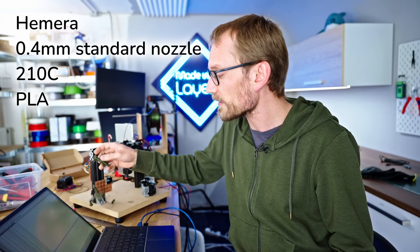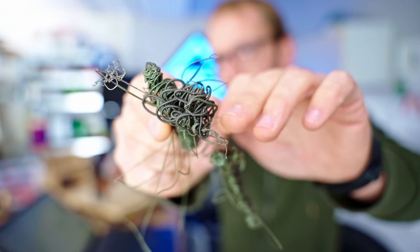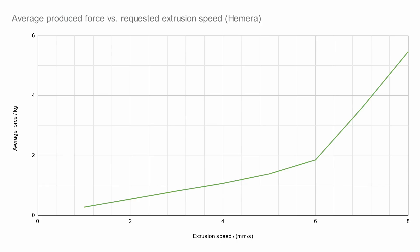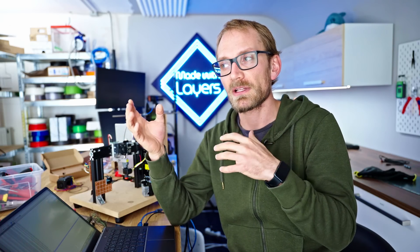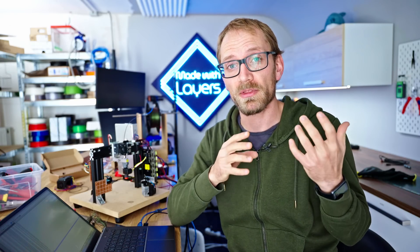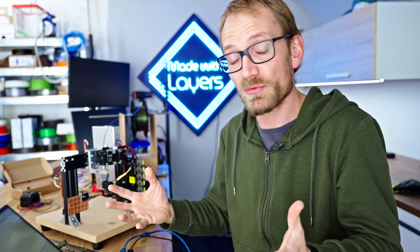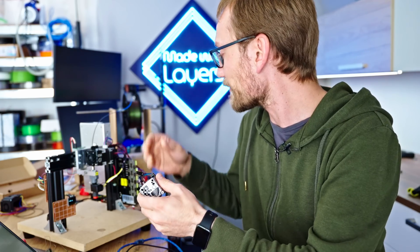With this setup, we're getting a useful extrusion speed of around six or seven millimeters per second. This is what seven did — you're getting some massive die swell, which sort of indicates that you are extruding too cold or too fast and the hotend is not keeping up. At eight millimeters a second, we are getting skips in the motor and in the gear, so that is definitely past the useful extrusion speed. That is right in line with what the limits are that I looked up beforehand — those limits are set so that you're extruding at like five millimeters per second with the Voron profiles, with the official Voron 2.4 profiles, and at around six with the profiles that come with the Prusa Mark IV and input shaping. Seeing that seven is too much and six still looks decent — that is good results, that double-checks that we are getting sane results in this setup. Next up, figuring out how I'm gonna mount this because everything is offset and all the mounting holes are different between each of these extruders.